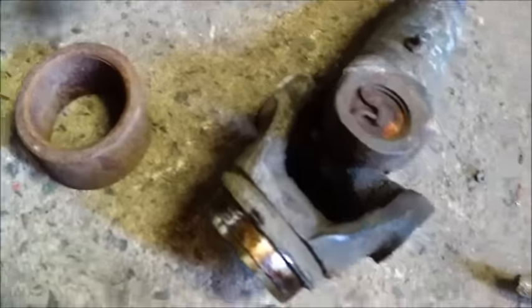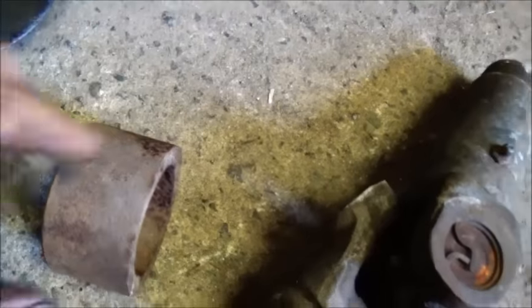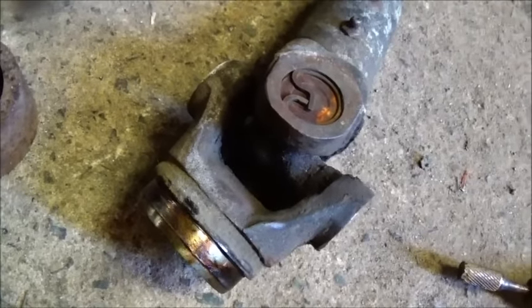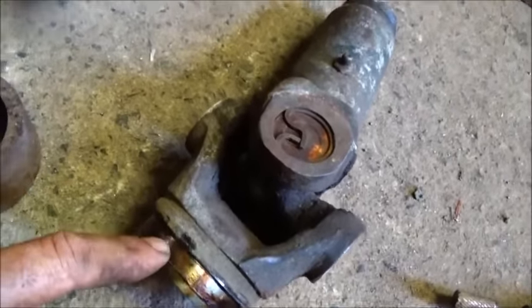This is just an old rusty piece, but that is what we're going to use. We'll go ahead and when I'm chucked, I'll be chucked back here. I can leave enough stuck out that I can turn here without crushing it, and it'll still be thick back there. What I'll do is get this chucked up good and straight, then go ahead and face this off and get it straight where it's been cut. We'll turn out the outside first, then bore the inside, and that'll make us a good face. This is not something you want to wrap duct tape around to try to get lined up — you'll still be throwing your weight off. You really want to do something that's going to put it where it needs to be.